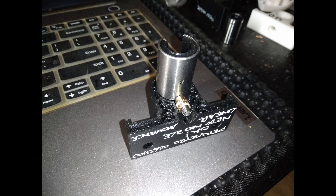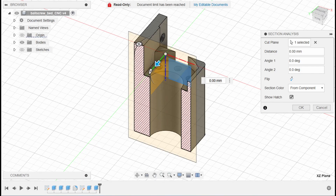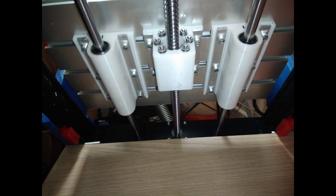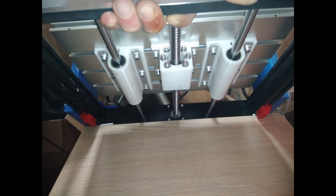The photo explains it better. I also added a ball screw. I designed the support for the ball screw with Fusion 360. This is a photo of the modded part — it is simple, just a support with holes for six screws and nothing else. In this photo you can see the support of the linear rods and ball screw mounted on the CNC. An important part is the aluminum bar for screwing the modded PLA part, because without it the PLA is not very resistant — the aluminum bar distributes the force over a larger surface.